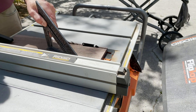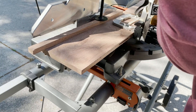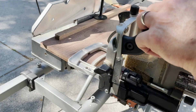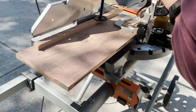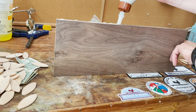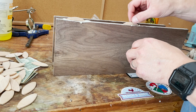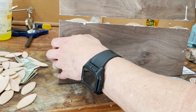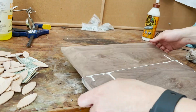I used half-inch American walnut as the false floor and the lid material. To get the width that I needed, I just did a glue-up of those walnut pieces. A glue-up is really just strips of thinner wood that are glued together to make a wider piece. The case is only about 18 inches wide, so I put three number 10 biscuits in and did the glue-up from there. The biscuits just kind of help keep everything in alignment — something like a dowel, a domino, or a biscuit keeps everything from sliding and keeps it flat.